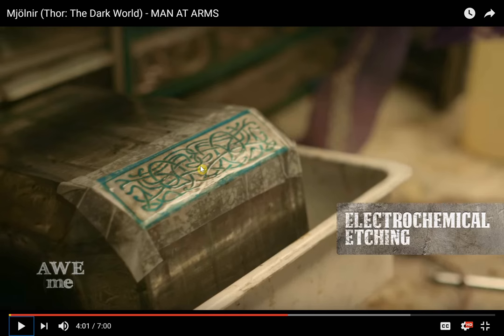So how would you do that? You guys were there for chapter 16. How would you etch this out? What would you do? Well, you could apply an acid to it. They don't do that. They actually drive it with a voltage. So what are they going to need to do? Anytime you have electrochemistry, you must have two things. They are anode and cathode, meaning that you have oxidation and reduction. So do you want to oxidize or reduce the metal hammerhead?